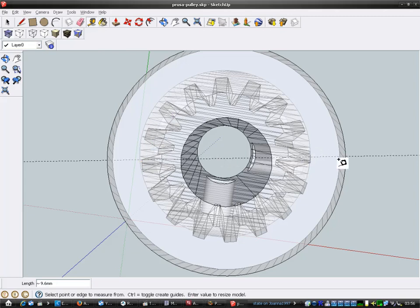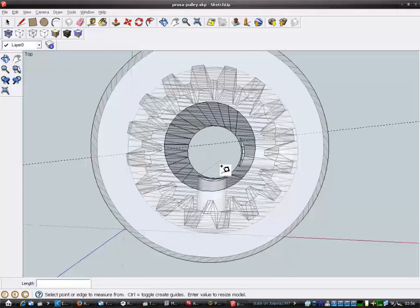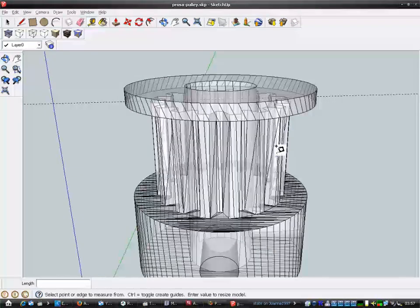if these teeth are farther apart, everything you print becomes oversized. So let's say I'm printing on the x-axis an object that's 2 inches wide. Now if the teeth are actually further apart, then that object is going to be too big, right? The same applies to the y-axis as well. If the gear teeth are too wide apart, you actually have more acceleration of the table or the print head, so you end up with an oversized object.